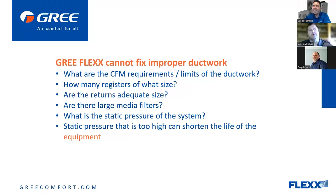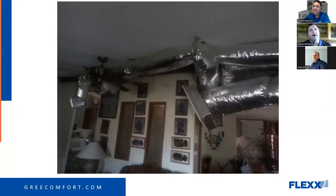Ductwork now looks a lot different than it used to. Every time we see pictures on ProTalk or Facebook, the ductwork people are doing now is significantly different. You don't see as many round pipe trunk lines with short takeoffs anymore — you see 40-foot runs of flex, wye fittings, ductboard triangle configurations, and things like that.